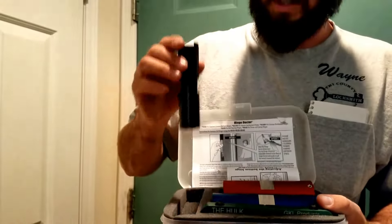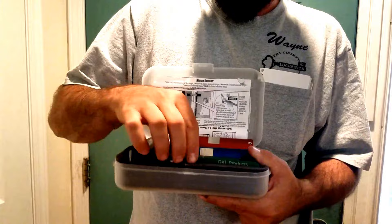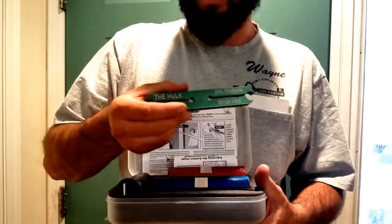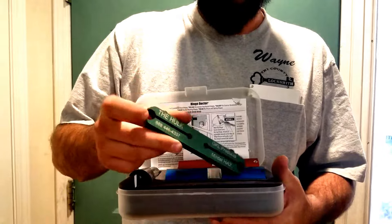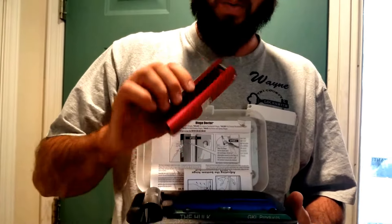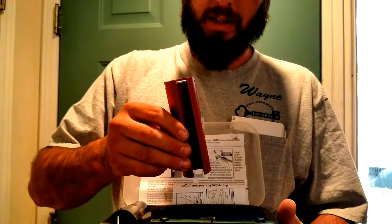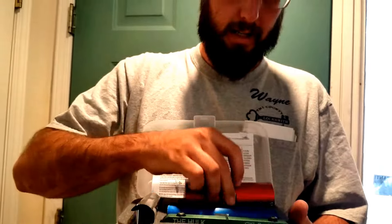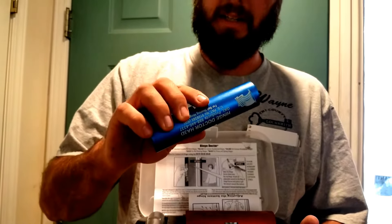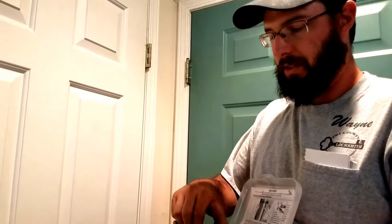Your black one is for residential hinges. If this one is too large then the Hulk will work. So the Hulk is actually going to use this one right now — I will demo the other ones but we are going to use this one right now. This one is for industrial hinges and this one is for prison or spring hinges. You just need to find the hinge doctor that works and fits over the hinge nicely without letting it come out the slot. The new hinge doctors have this slot ground into them so that you can use a crescent wrench to actually bend the hinge. You can also use just the door itself — multiple ways to use the same product.